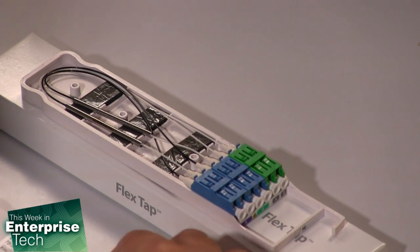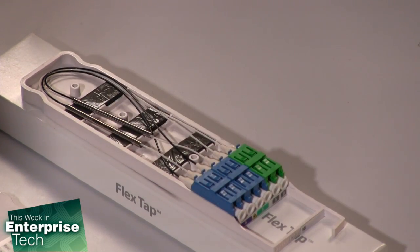Chief, let me ask you about this. We both worked with a lot of technology like this. Richard used to be right, yes? In the old days of networking, you actually did require a prism — some fancy equipment inside one of these boxes to get the tap. Actually, yeah. In the old days, when NASA was using the star switches, it was a set of semiconductor mirrors to flip the light around, switch it, and tap it. The trick is we're using physics: when you're bouncing a bunch of light around inside a tube, if you scrape away a little bit of the cladding, a little bit of light is going to leak out. You can actually make your own — single-mode taps are pretty easy to make.